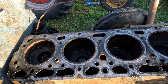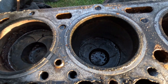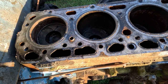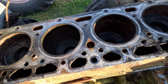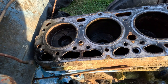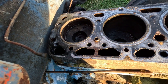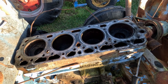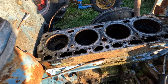That's why we couldn't break it loose — there's just too much rust. When I first got the head off, cylinder three was pretty much empty, so that cylinder had done what it should: the liquid penetrated down the side past the rings, so you probably could free that one up. But the others — I've seen a lot of people use a block of wood and a big hammer to pound on top of the pistons and try to break them loose. That might work here, but it'll pop all the liners up and then you have to reseal them. If you pull the liners out, they might as well go in the bin and just buy new ones instead of pulling it apart multiple times. We could free it and get it going — that's a definite. But how well is it going to go? The pitting in those liner walls means it's just going to be a smoker, it's going to use oil, and probably won't go that well.